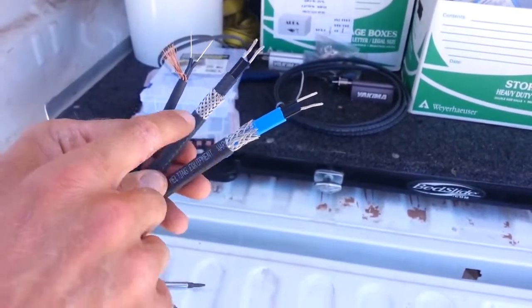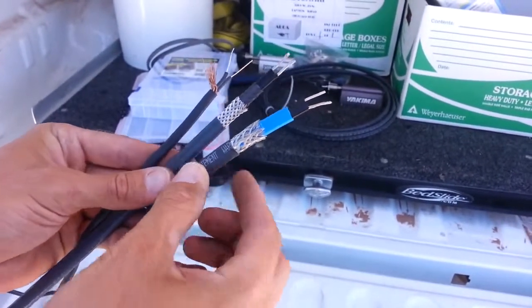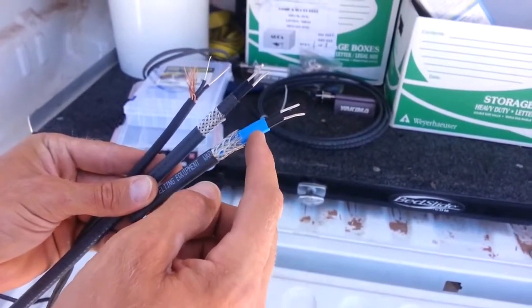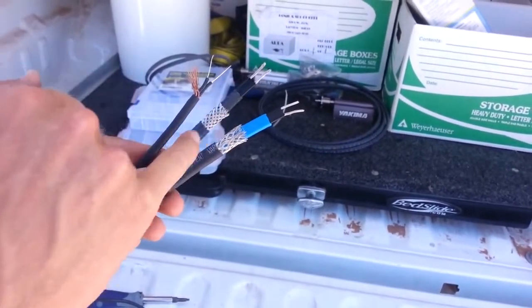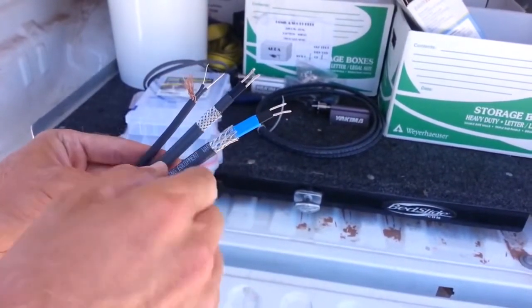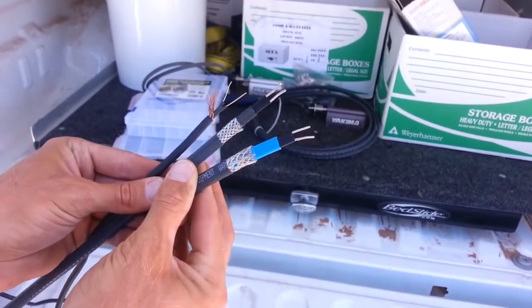This one is also the same comparison. It's a self-regulating heat tape. In comparing these, you'll see this has a blue coating inside. It's an indicator letting us know that it's a 120 volt heat tape, not a 240 volt. These two are actually about identical. Their performance, the heat output, everything it does, they function the same way. They're pretty much the same type of cable.